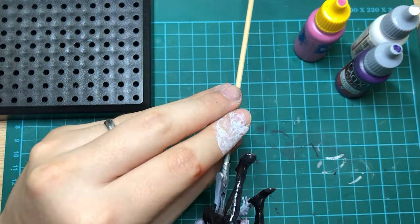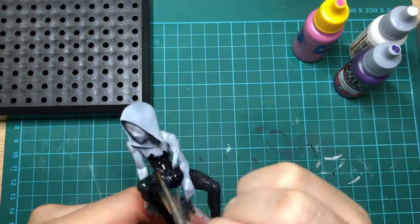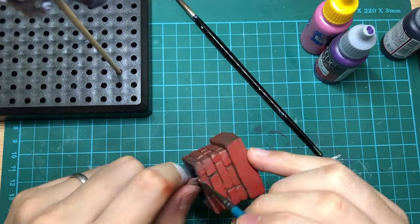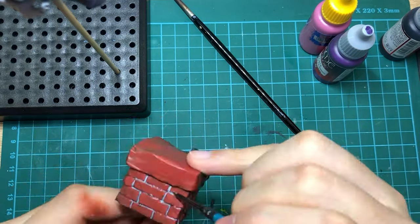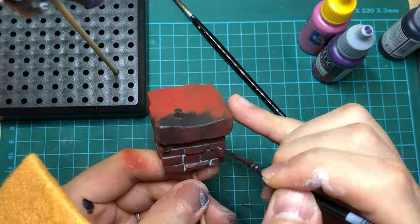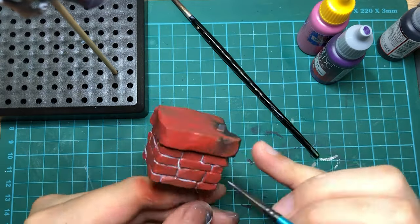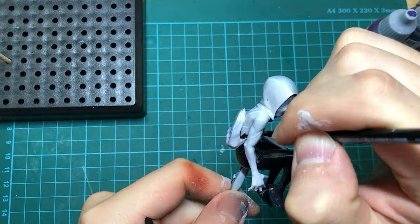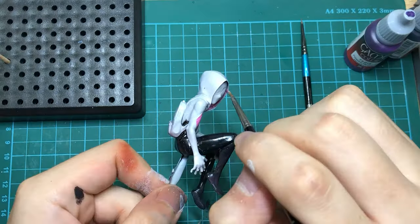Hollow parts in general save resin, but because I shrank it, some parts that were already thin became much thinner and did not print perfectly. You can see some of this artifact on the side of the hood. One large issue I faced was with the separated leg — when curing, I must have done something wrong because it started to warp a little bit. The fitting ended up bad, and there was a large gap at the joint from the leg to the body. I eventually had to use super glue and a lot of green stuff just to fill the gap and smooth the surface.